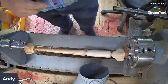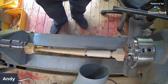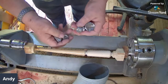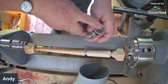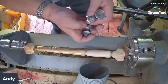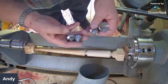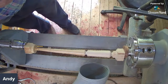Robbo's asking: what tailstock centre is this? It came from Axminster — it's a live multi-point centre. It has five bits that go in: a cup one, a ring centre, a pointy bit, a bigger pointy bit, and then the one I've got in there, which is like a face plate with two or three screw holes. I put one down through the middle for this. It's a very useful little gadget — I've used it no end since I've had it.